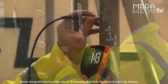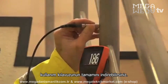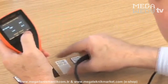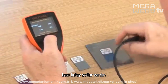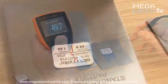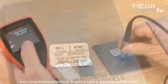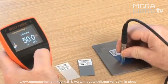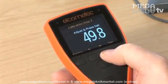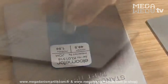For more information, a full instruction manual is available at www.elcometer.com. There are a number of ways to increase the accuracy of your calibration. When calibrating or taking measurements with your gauge, here are some simple do's and don'ts. Take more readings on each foil value or bare substrate. The gauge then averages out the readings, increasing the adjustment accuracy. Using the up-down soft keys, you can then synchronize the average reading so it is identical to the certified value on the foil.